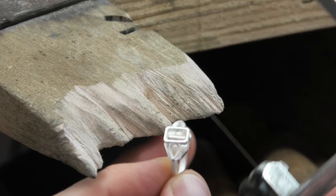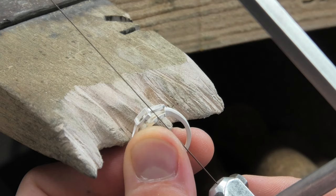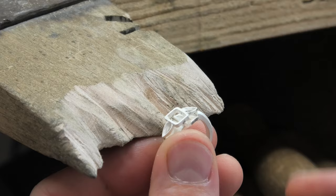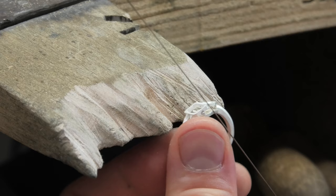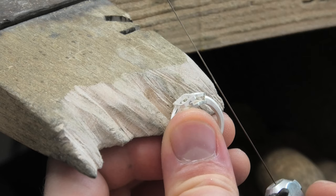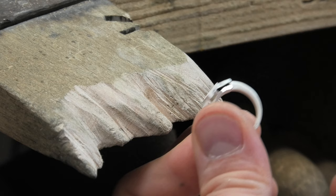Going into these bits I've cut around it. Next, got to cut a little bit out of there — I sort of line up with a corner and cut directly into it, not too close to either side, just sort of down the middle up to that point. I don't saw right up to it either — I let my file do the work. You can do much more careful accurate work with your needle files than you can sawing into it. Bear in mind how you're pushing against your peg as well — you could push that out of shape quite easily, and don't let your saw hit the bottom of your shank.